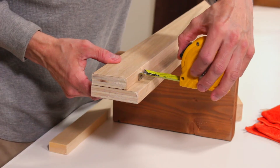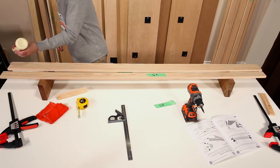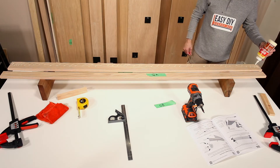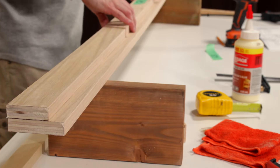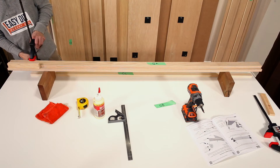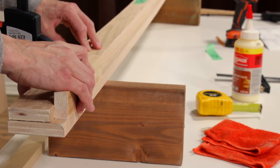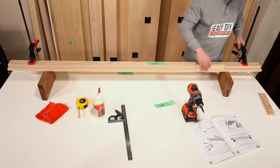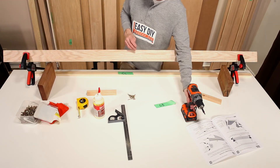If this measurement is less than three-quarter inch, it may interfere with the footer end of the face panels when the bed is closed. You may run a bead of wood glue on part GB. Reposition the two parts together and flush them again. Clamp part GA and GB together. Flip the clamped parts over and drive equally spaced one-and-a-quarter inch wood screws into the back of part GB to secure it to part GA.